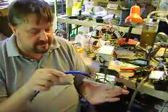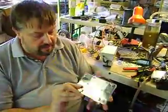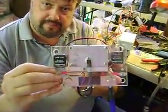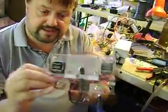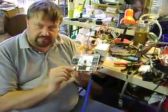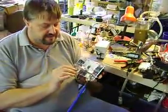We also have a 100-amp shunt that's mounted on here. And this is the most exciting part — a much bigger fan with the MOSFET, mounted to a bigger heat sink to take on the heat. This particular MOSFET is rated at 265 amps. However, as a 100-amp unit, we're probably going to go with a slightly lower rated MOSFET.